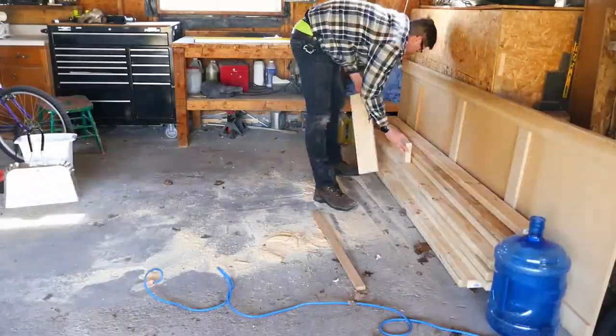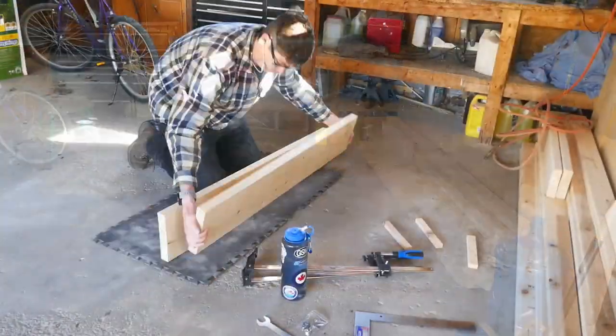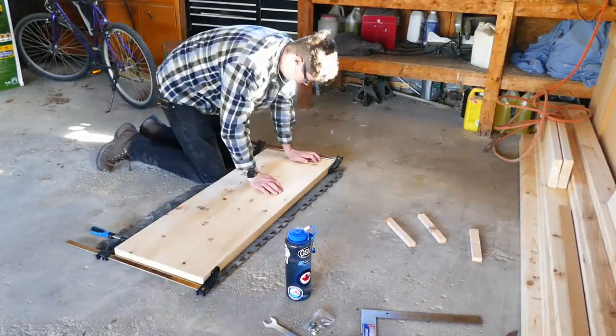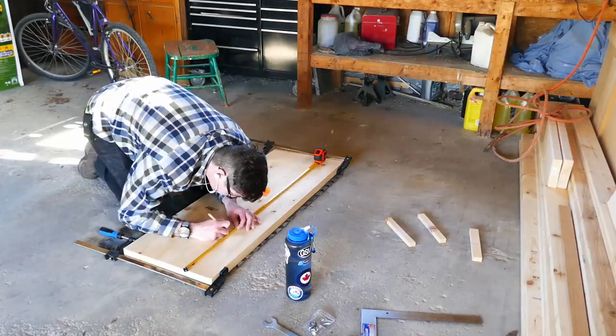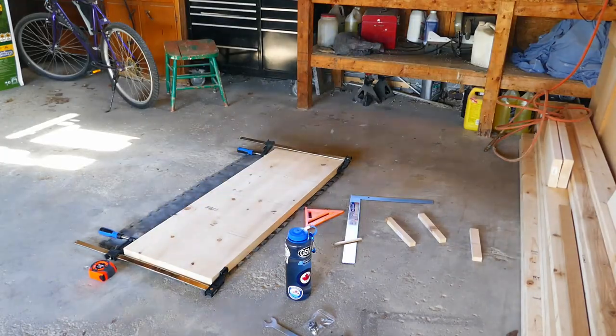I like working in a clean garage, so after every phase of the build I clean up after myself. With the garage clean, I set up the two sides and cut the grooves that hold the three middle shelves in place. First I clamped both pieces together, which allows me to cut a groove in both sides at once. That way, if I make a measurement error it's duplicated and the shelf will at least stay level.